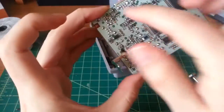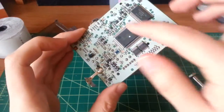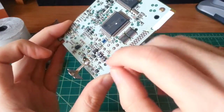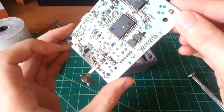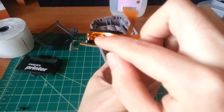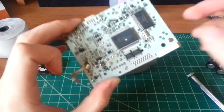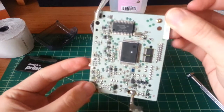This section, as I mentioned before, is the switching power supply. This chip here is the main processor, with output to the printhead. Motor drive is probably accomplished through these two switching transistors. There's probably some kind of H-bridge configuration so it can modulate that. That's pretty much all that's in here.